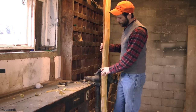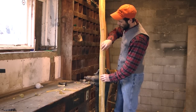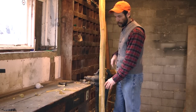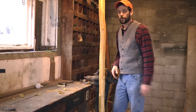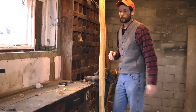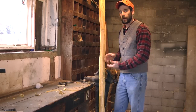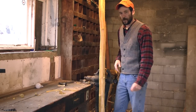And what I mean by that is, if we've got a piece that's long like this, and we're only going to take a 65 or 67 inch bow out of it, we can move it one way or another so that it lays out on this piece of wood. Say if we've got a knot like this that's going to be right in the middle of the working part of the limb, this knot's not going to cause any trouble. But if we did have one that was going to cause some trouble, we could possibly avoid that knot by moving the bow down or up, getting this closer towards what would be the riser part, or towards the limb tip that doesn't work so much. So a lot of different options.